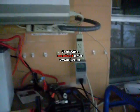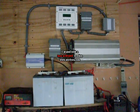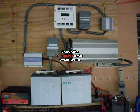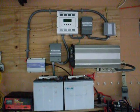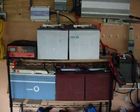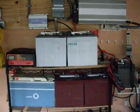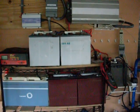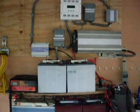In case most of you don't realize: when you change your DC to AC and you're inverting that power from 12 volts to 120 volts, you actually have to do some math there because your amps are going to drop. You're going to divide everything by 10. So if you have 10 amps coming off of your panels, you're only going to put in one amp AC into the grid. Vice versa, same thing. In this case, I've got — without the 12-volt battery — a 560 amp-hour battery bank at 12 volts. When I send it through my inverter and it goes to 120 AC, I only have 56 amp-hours AC battery bank. So if you put a load — AC, that is — say a 1-amp draw, you're actually drawing 10 amps from your battery bank. I found this out about a week and a half, two weeks ago. It's kind of depressing, but it's good to know this information.